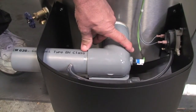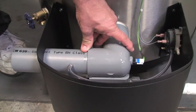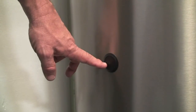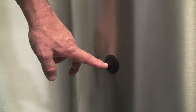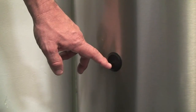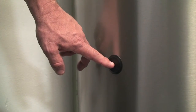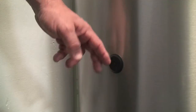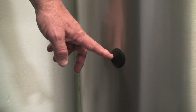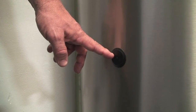This safety is incorporated right into the exhaust and sealed with an O-ring seal. We have our safety limit, our water safety limit, high limit, and our operating limit NTC. It's a four-pin connector with two sensors potted in a stainless steel enclosure. What that does is sense the tank temperature and modulate the burner accordingly, and it also provides a safety for its high limit setting of 194 degrees.